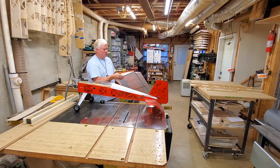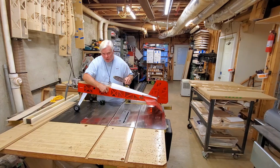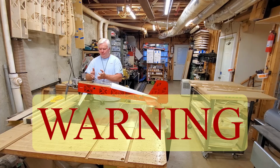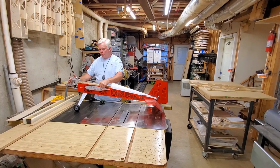We want to make sure that we leave enough room here, or at least we plan ahead, to put the wing socket, the anti-rotation pin, and the bolt hole that holds the wings on. I wouldn't really call it a rule of thumb, but an observation in sport planes has to do with where to place this wing forward and back, and of course up and down, which is where the maximum thickness of this wing is placed in relation to the prop. I don't know that there's actually a general rule there.